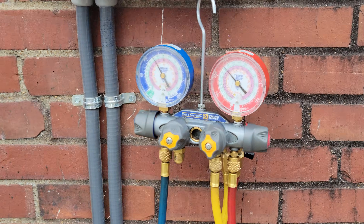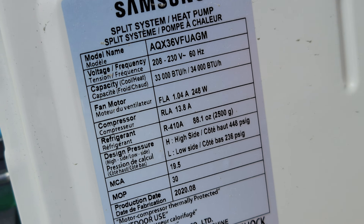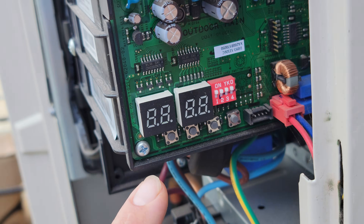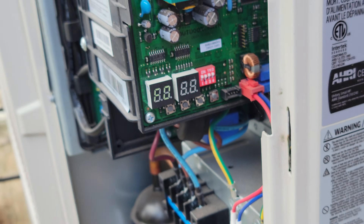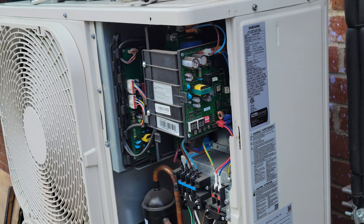Always factory charge — 88 ounces, so divide that by 16 and you'll have the pounds. Always push K1 after you start this equipment up. F3 is to reset. You can also test cooling and heating operation through the K switches.